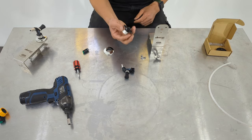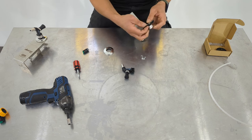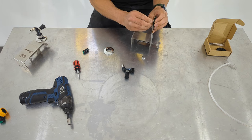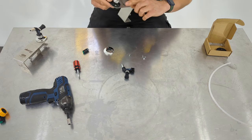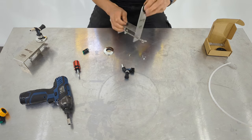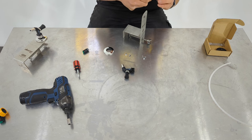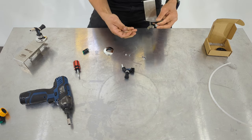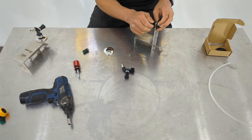We're only going to use these parts here. We've got the shank sitting on the front, then these M5 screws that go on the front. Then there's a nylock nut which screws onto the back — just do it up finger tight, and do that to all three nuts. Actually, I've made one small mistake: see where it's got the arrows showing 'this way up'? It is slightly better, if you know which orientation you'll use this clamp-on assembly, to face that in the direction you want facing upwards.